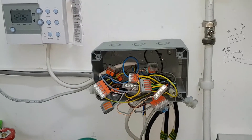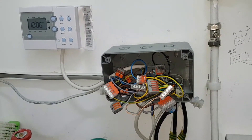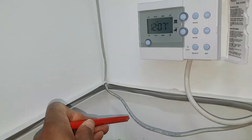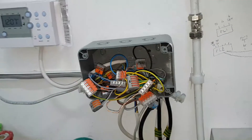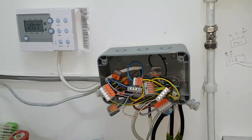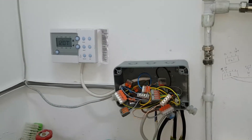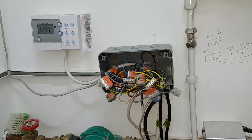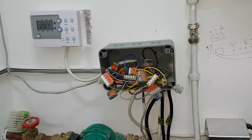Our mission is to correct all this, rewire all this. We're going to put in a Wiser Kit 3 because I've got two thermostats. One thermostat is going up this wire here using bell wire, goes up there, and the other one goes that way — also on bell wire. So we're going to put in a Wiser Kit 3 system and rewire this. This is going to be done by one of my students who's done my mentorship program — Marius. And he's going to sort this out. This job was put in by guys who may be three, four years ahead of him in installation, electrics, and boilers, and they've gone and done this mess.